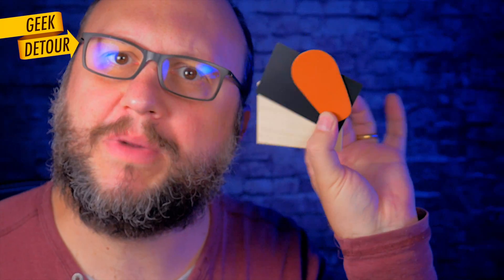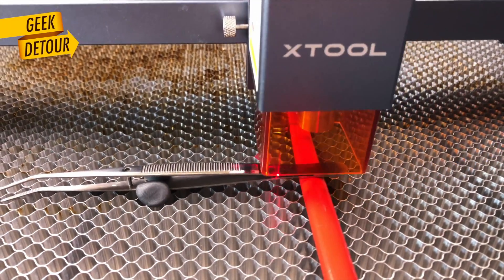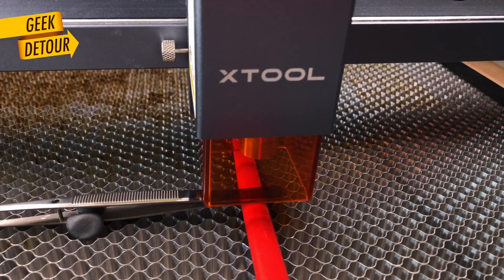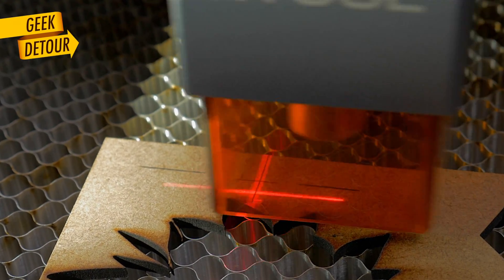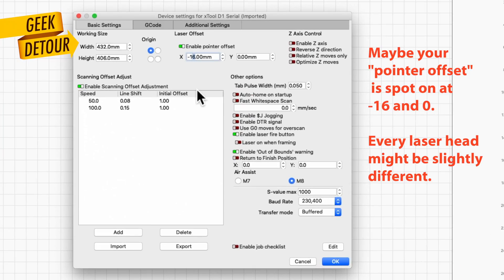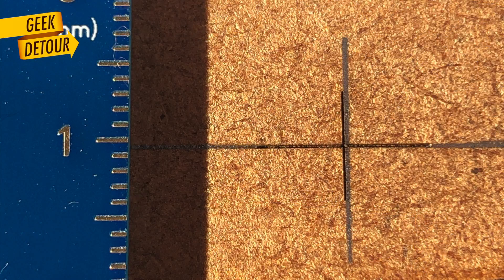XTool provides a few sample materials for testing, including a stainless steel PET tag. I was curious to see if I could engrave on my surgical stainless steel tweezers. I used the crosshair laser pointer to carefully centralize my initial position. But the result ended up at the top — I was pretty sure I had centralized the crosshair. So I made a test, measured the difference, and was able to fix it in the offset settings. Let's do it again — the crosshair is totally on the mark. Much better. Now I think I can trust the position of the pointer. Testing the other side of the tweezers: spot on.